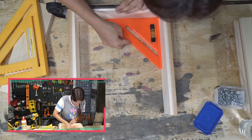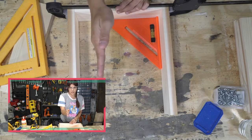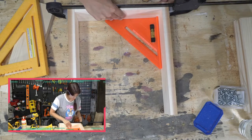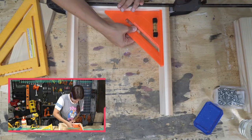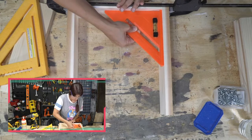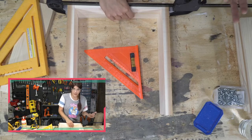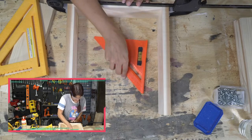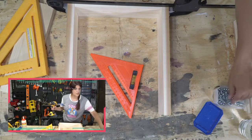And guys, I calibrated my miter saw because I noticed that even with straight cuts, it was a little crooked. And I always struggled to get these boxes, or any type of corner, correct. So that was well worth it. Making sure there's no rocking or almost no rocking. Sometimes it's just because not all wood is straight. You can try and cut it as straight as you want. Sometimes you'll get a little rocking, but nothing enough to really jack up your project.